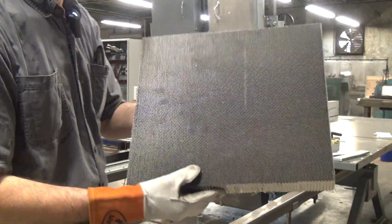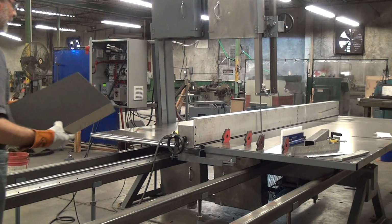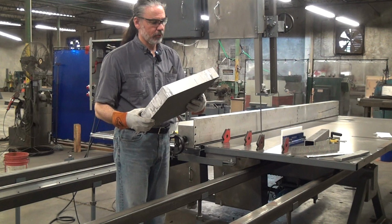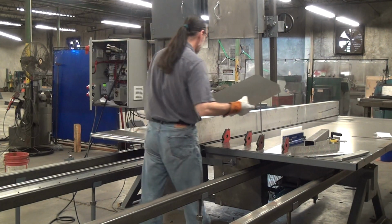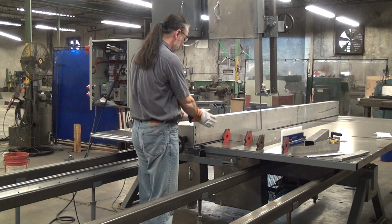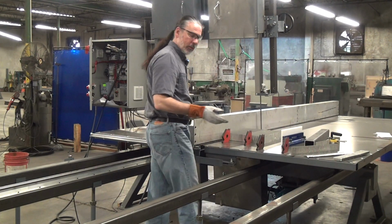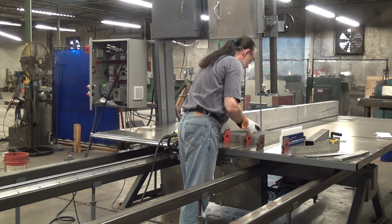There we go. My understanding is, as these type of materials go, this is a relatively high density material. Heavy wall, small cells. So it's kind of the worst case for this application. As I mentioned, we do have a workpiece positioning fence here to set the distance from the blade to your reference surface. I'm using right now just some magnets as positioning tools. So I've got a couple magnets here to position off of.